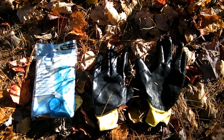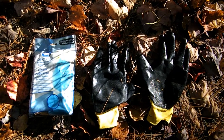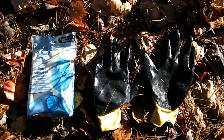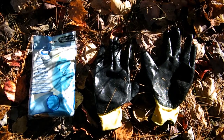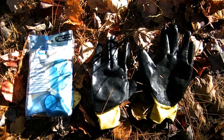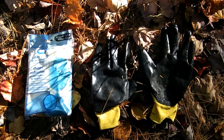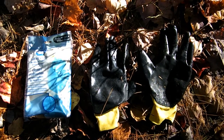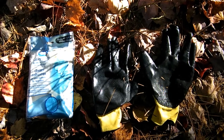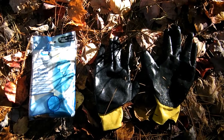While constructing the stack wall, I used a single pair of latex gloves — still functional after the whole build. Over those, I used mechanics gloves, and I burnt through a bunch of those, but they're less than a buck each. The mechanics gloves take the hit and still give you tactile control, while the latex glove protects your skin from burns. This worked great.